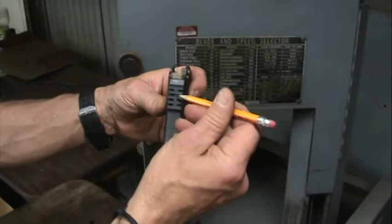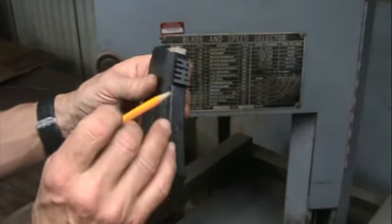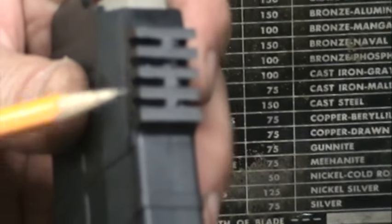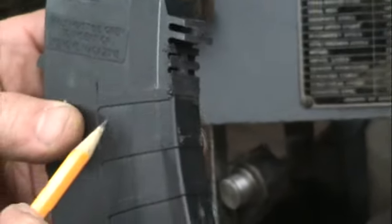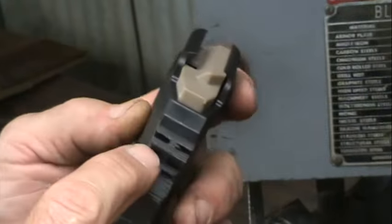As you can see, we have these little ribs here. I've cut the middle one out. What we want to do now is cut these bottom three off. I'm going to use the bandsaw to make a rough cut from here up to here, and then we'll use the grinding wheel to kind of smooth it all out. We've got all these cut off and we keep the top two. I'm going to take a grinding wheel and smooth all this out to give it a more pleasing cosmetic look.